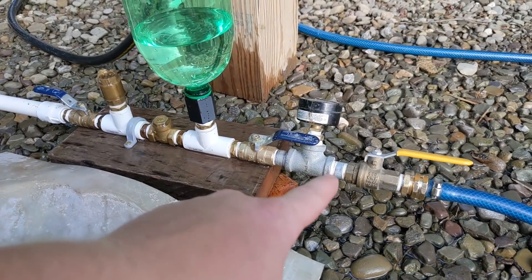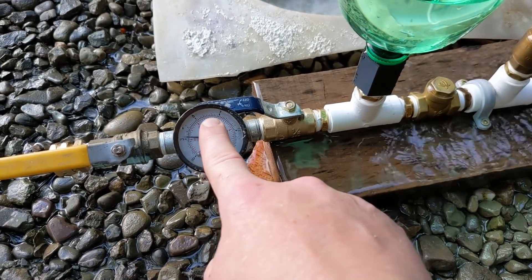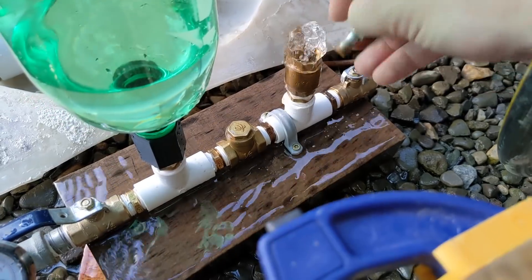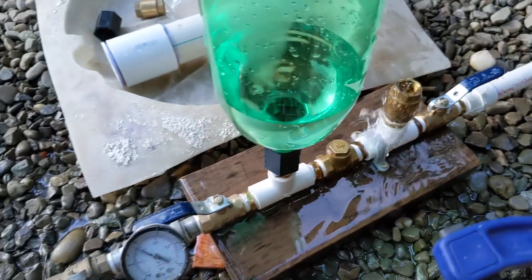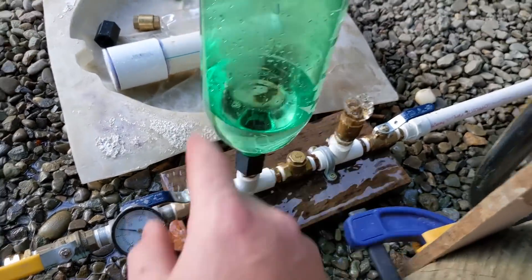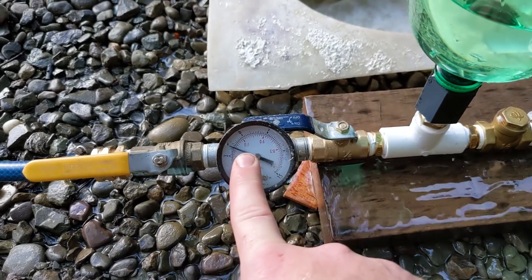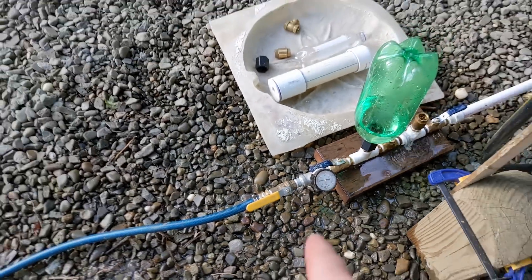This just has some valves and there's a pressure gauge. With the weight on, I was able to get up to 8 psi. I took the weight off because it makes the valve a little sticky — it just gets stuck in different spots. So I took it off just to see it run long-term and test that. At 8 psi, that's equivalent to 18 and a half feet of delivery height.